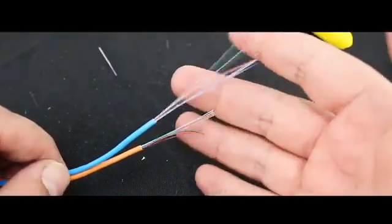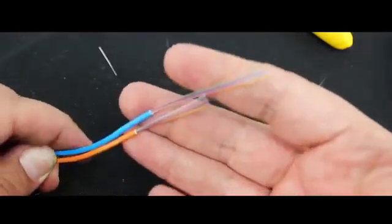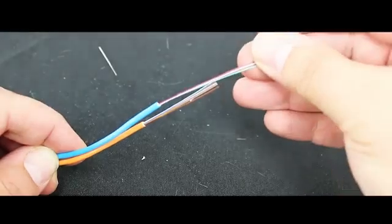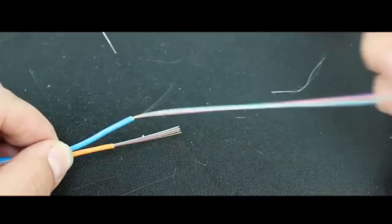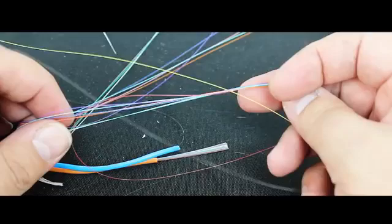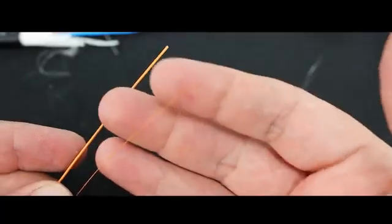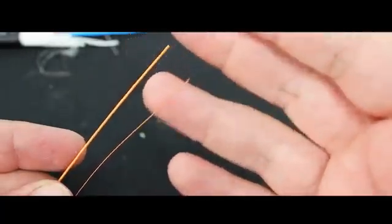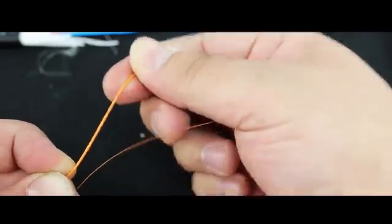So loose tube fiber optic cable is basically this. It's a tube with loose fibers in it. Real quick, I do want to show you the buffer cladding comparison. This is your loose tube, the 250 size. Kind of feels like a strand of hair. The other one is the 900, and this is what you'll find most common with tight buffered type of cable.